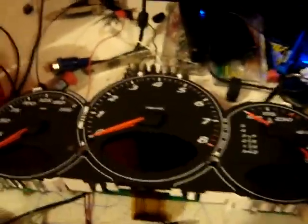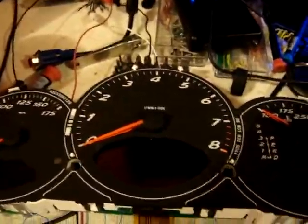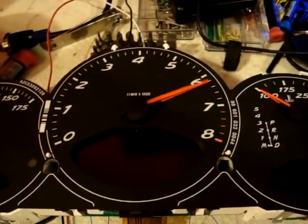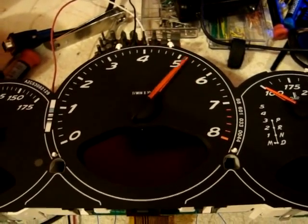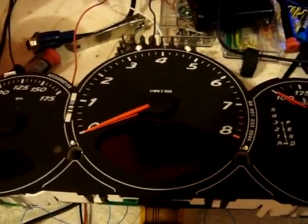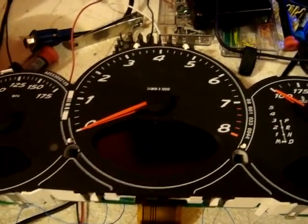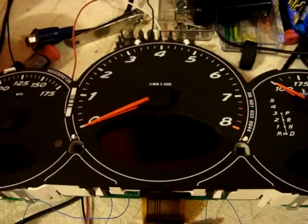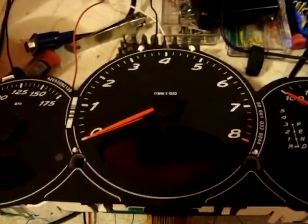So it turns out to work really well - it's been a lot of fun doing this. Eventually I'm going to turn this into a core CPU usage gauge that I'm just going to set to the side of my computer, and it would constantly be going back and forth. It's a little bit loud, but I could use more of a sine wave instead of a square wave to try and quiet it down and smooth out the steps.